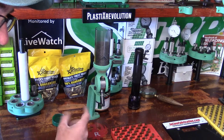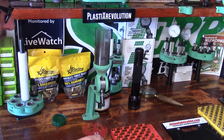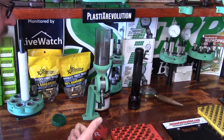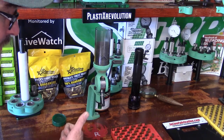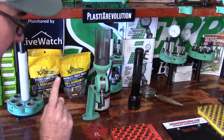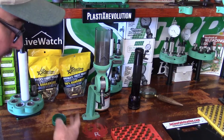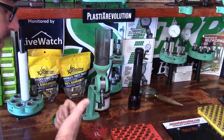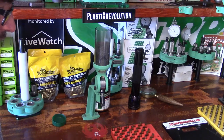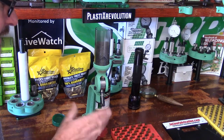So now, I'm going to tell this to Willie and the viewers. When Willie always does a good job identifying the primer, when he always does a good job of cartridge overall length, proper bullet seat depth, he always makes sure he has the correct powder, he double checks the charge on the scale and he compares that back to the recipe, and he does this, he will never ever have a problem with grenading a handgun in his hand. He won't have a squib, a bullet stuck in the barrel. He won't have a double charge. And this is how you do it.